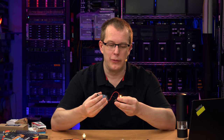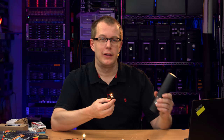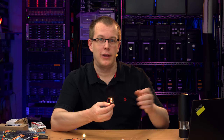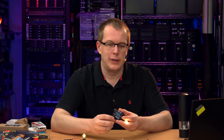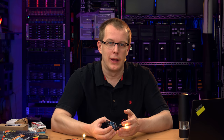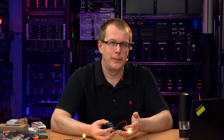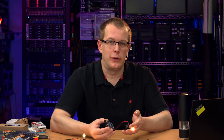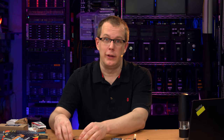But that doesn't mean they're dead. In fact, that's a good lesson to take for home use — a lot of times when batteries appear to be dead, when they stop working in some device, they might still be useful in others. For example, if you had an incandescent flashlight, or a pepper grinder that takes a lot of current, it might stop working, but the batteries might still have more than enough power to operate your remote control for another few months. So keep that in mind: even when batteries seem dead, they're not necessarily dead. You can always test them with a multi-tester or battery tester — they might still have 1.2 or 1.1 volts left, and be useful in lower-current devices like an LED flashlight.